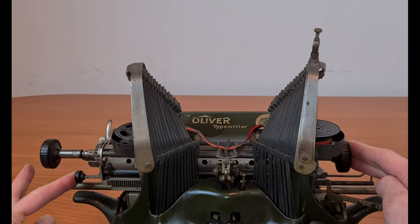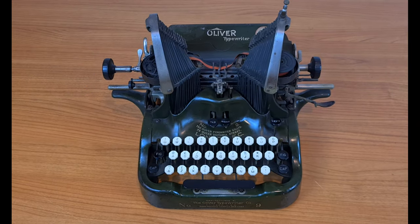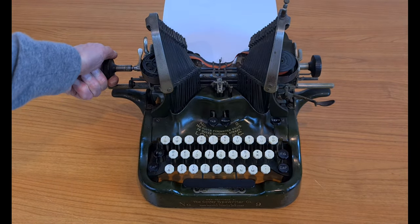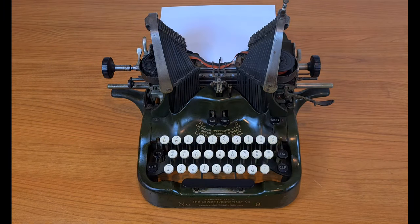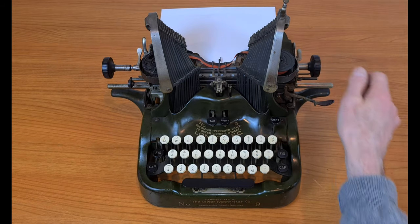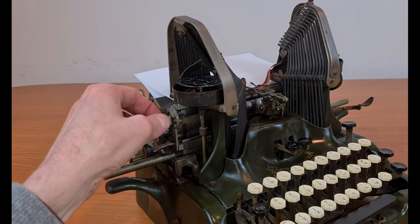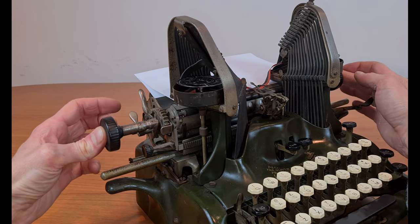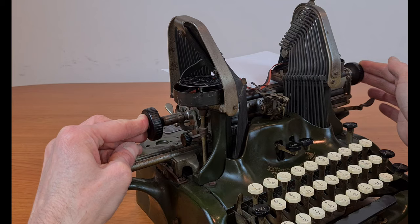This knob is to move the carriage back and forth, and the same on the other side but it's a lever. I insert a sheet of paper. This lever is if you want to adjust it. This wheel is to move the roller independently of the ratchet wheel notches, to make a correction, center the letters on the line, etc. Here you select the interline. The interline is quite particular — there is no lever; you have to press the knob of the main roller, and after you hit the margin, the selected interline is applied.